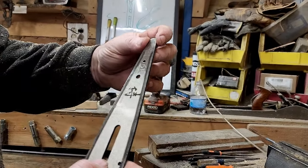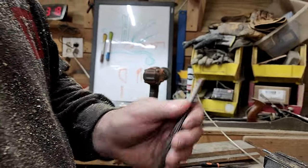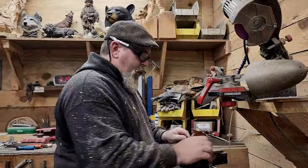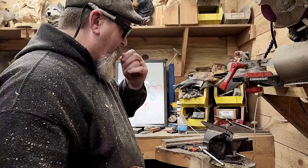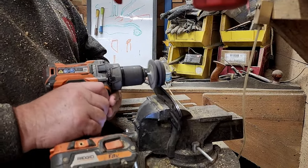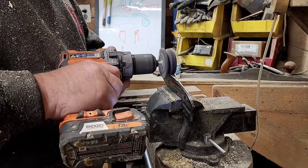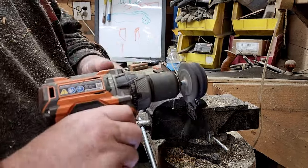Everything from the factory has cross-grain grooves. So when I say 'dressing the bar,' it means getting rid of that cross grain and getting the micro grooves going along — elongated — along the trail to the tip. You need to get yourself a Scotch-Brite wheel if you don't already have one. Any cannon bar you get is always painted, and any steel bar — you want to get underneath that paint because they're all the same, they all have cross grain. What you want is to have your micro lines going lengthwise to help move oil to the tip, because cross grain produces a lot of friction.